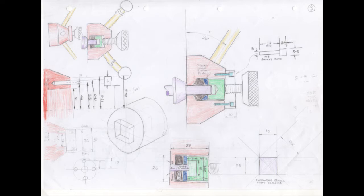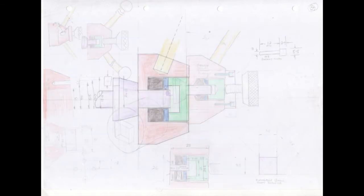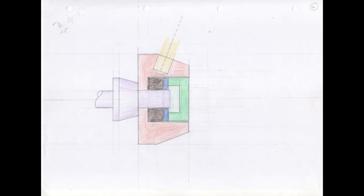Sheet three has an idea I quite liked. The hub has been drilled and then filed square at one end to slide over the quill spindle — that's how it keys onto the spindle. At the other end there is a bolt you can screw up by hand; as it screws up it pushes against a piece which then pushes against a thrust plate and squashes a rubber element. That rubber squash holds the hub onto the shaft, and unscrewing the bolt releases the pressure so you can pull it off. On sheet four I drew this out at twice full size and found that with the material sizes I had I couldn't get all the fixings in, so I had to shelf this idea.